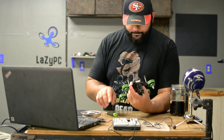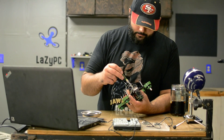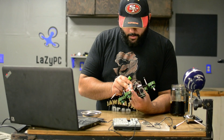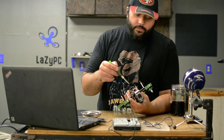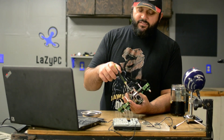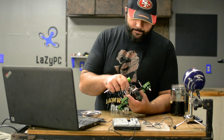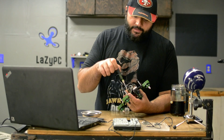Got it remounted like so. Always make sure when you're mounting your flight controller that it is nice, tight, and level to the quad, because you do not want any difference in movement between the actual quadcopter frame and the flight controller. Otherwise, the flight controller won't operate properly — it won't know which direction the quad is truly moving and which way it needs to correct.